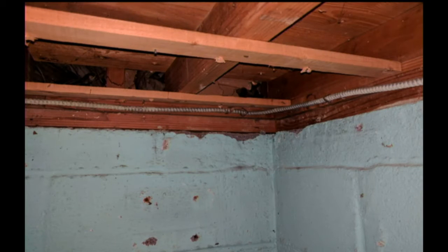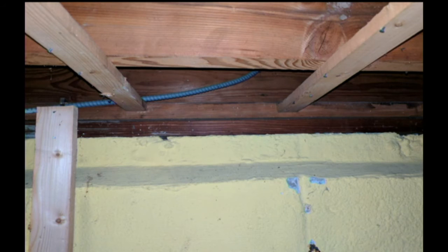One other thing: this area right at the top of the wall — you see that wire in here and that gap in between where you have that trough recessed back in — this can become a really nice service or wire chase area where you can run cable, a couple of wires, and do drops to really power your house. But what I'd like to talk to you about is our typical layout.